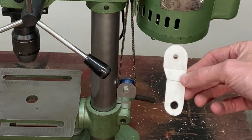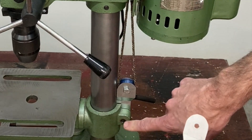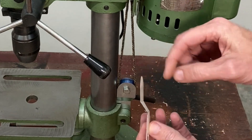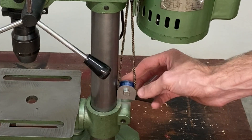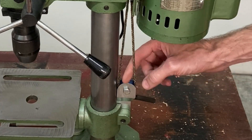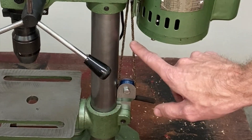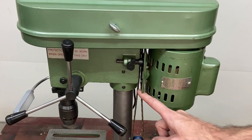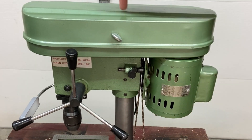I just used a little piece of poster board and sketched out what I wanted. There's a 10 millimeter hole at the bottom that the clamp bolt fits through, and I marked out where my bends were going to be offset for the bearing and pulley. The pulley itself is a 608 size bearing that I got out of a roller blade wheel, and I 3D printed the little grooved pulley that presses onto the bearing. Right now I'm just using some paracord or nylon rope. This inner line is static line — it is fastened at the top, runs down, goes back up, and then under the cover here.